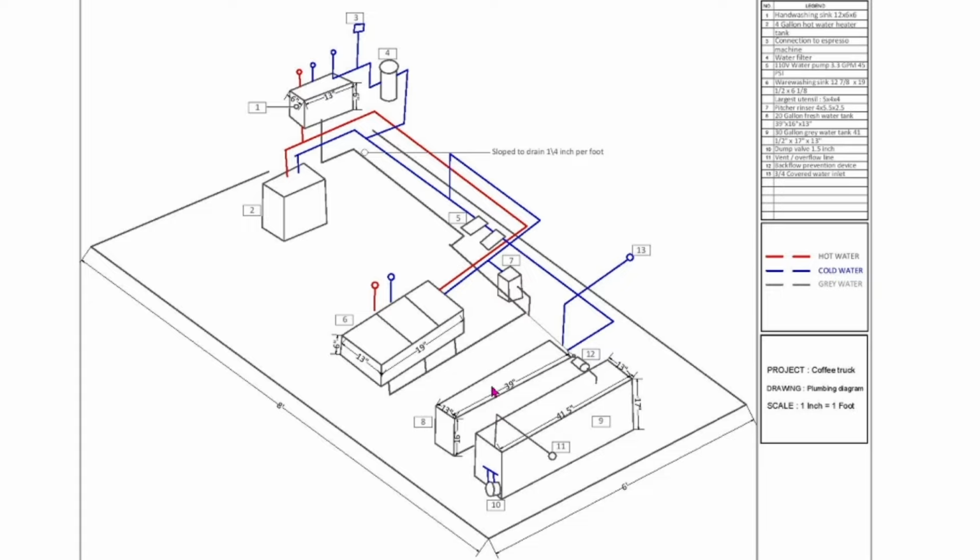You need a vent both on your fresh as well as your gray. You need it on your fresh, not necessarily to vent out odor because it's fresh water, but so that you allow air to get out, because otherwise it'll bulge and it'll kind of mess up your tank over time. And then your vent for your gray water, you need that to allow the nasty smell out. So you want that vent to go outside your truck. I think both vents should go outside your truck, just in case you overfill your fresh for whatever reason, you're not spilling water all over your truck.